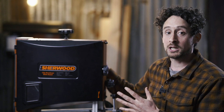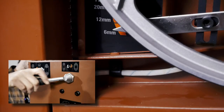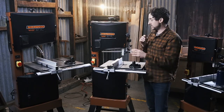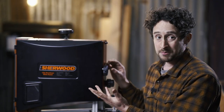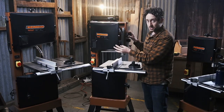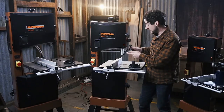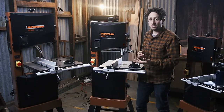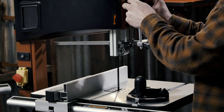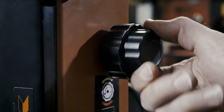The two larger machines have a quick release on the tension adjustment which makes changing the blade a bit easier — really handy if you're changing blades often. All three machines share a similar door design with quick release cams, and I think they work great. Another advantage: the doors are switched, so if the machine is running and you open the door, the machine will turn off. They also have a nifty ability to raise and lower the bearing guide using a double twist knob system — one raises and lowers, and the inside knob locks it off.